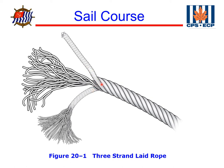Each of these lines wraps around the rope, and inside there's another smaller rope. If we wanted to make a really heavy line, we could create larger rope by combining strands — starting with threads, getting to quarter-inch, then half-inch, then a one-inch line — combining three ropes at a time to bulk up the rope to whatever strength and ease of handling we want to achieve.